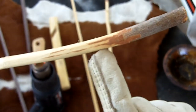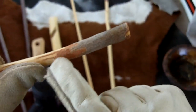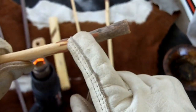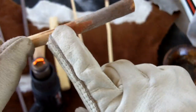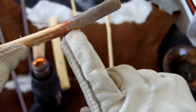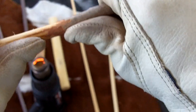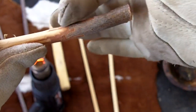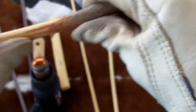I just heat the compression side — the side that will be in compression when I bend to straighten it. The reason for that is if you heat the tension side when you bend it, it tends to crack easily. But if you heat only the compression side, it becomes more plastic and will just kind of crush in on itself. And then when it cools, the tension side is not really affected, but the compression side is. There's not going to be any cracking — it's just going to be compressed.